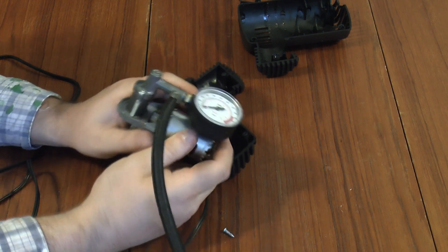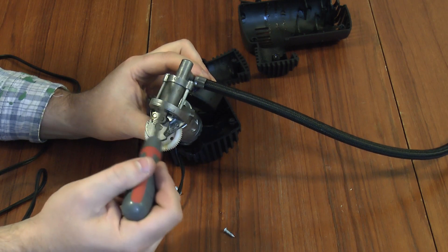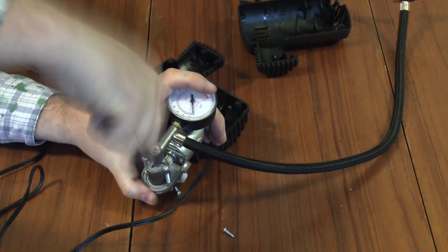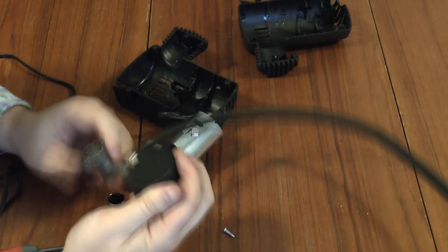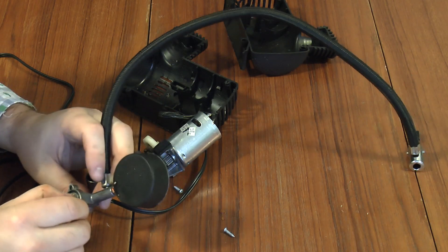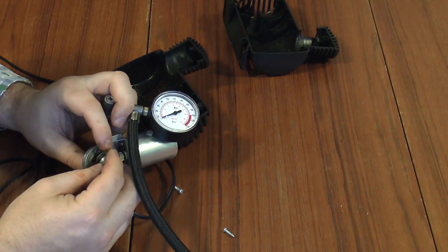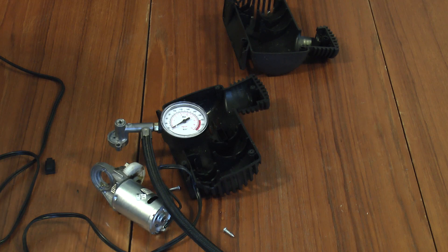That's what's gone wrong — the cog has sheared clean off. This compressor doesn't look as well built as the MVP. These screws aren't set level; this one's not been done up quite so tightly — you can see it's slightly offset. The ring has seen better days, and in fact with the piston fitted I can actually blow through the piston, so that's no longer sealing correctly.